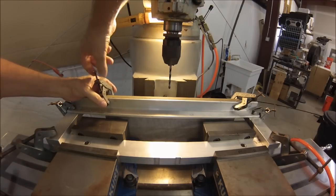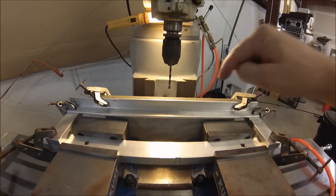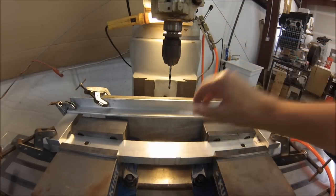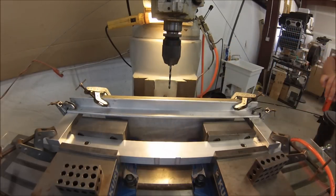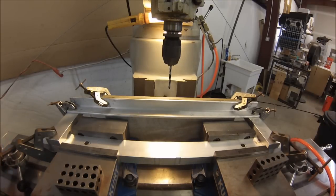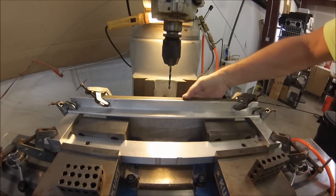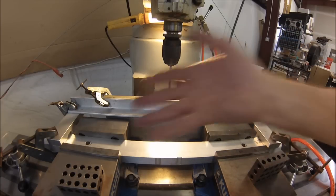Take your clamps and clamp it off. Now here's the one thing you're going to need to remember if you're ever going to use this trick: don't forget to take the 1-2-3 blocks out from underneath this plate. If you're going to be really driving down on this thing with a lot of pressure, sneak them in when you do the holes so this doesn't shift. Pull the 1-2-3 blocks out. Take the handles off your vises as well — pull these off, because if you're like me, it's just instinctive to go for the handle first. Everything is locked in, there's no oilers in the way, there's no digital readout scales in the way. Back and forth, in and out, up and down — you've got plenty of room. This plate is 11½ inches tall, and under normal circumstances with a 2½ inch projection on your drill, you'd be in a whole lot of trouble.